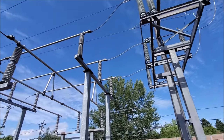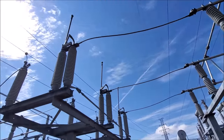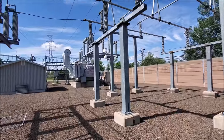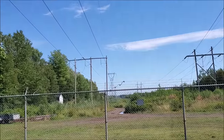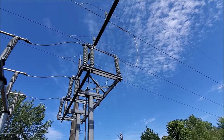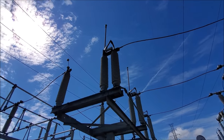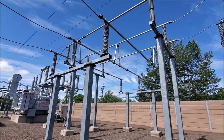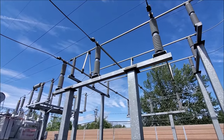So we come on through these leads into our bus work. Now the reason we go from the switch to bus work is we have a tie. This tie switch is open because we have two independent feeds for each transformer. If there happens to be a fault on this high line we would lose power to half the town. We can open this switch to isolate the transformer and close our tie switch, which essentially is stealing power from this high line in order to feed the other transformer. Pretty simple setup — mind you, the process is much more complicated and time consuming.